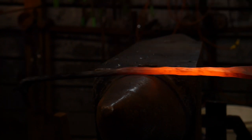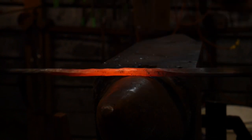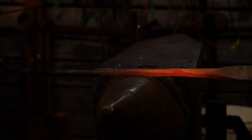Now if you do too much feeding from the end of the bar stock back into yourself, you will create what they call a reverse taper, and you don't want that. So you want about equal amounts of movement going forward and going in reverse.